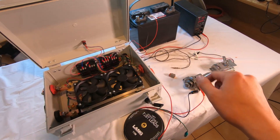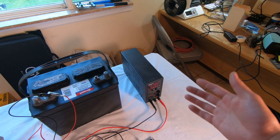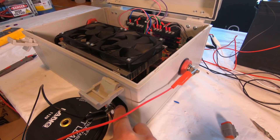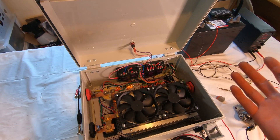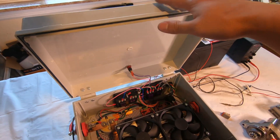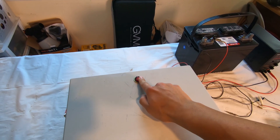I have this hooked up to the starter motor and potentiometer from before. On the left you can see the high-voltage traction battery terminals, and on the right and front you can see the motor output terminals — positive and negative. I made a few changes to the design beyond the wiring diagram. First, there's a small LED light: when I turn on the key it supplies power to this light and it glows red. It's a good safety measure — if the key is off and the light is on, you know something's wrong.